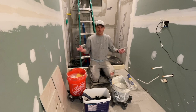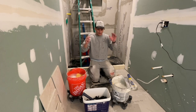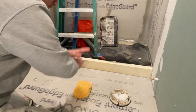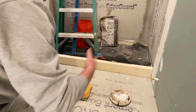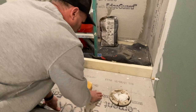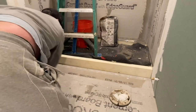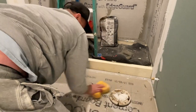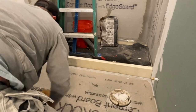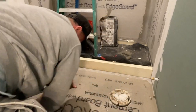So that is the intro to tiling. Now let me get into how I actually tile the floor. The first step: you want the substrate clean — sweep it, vacuum it, make sure it's flat. Pick up any mortar lines around and chisel them up. Then you wet — not soak — but just wet the cement board or hardy backer so you don't have a moisture issue.